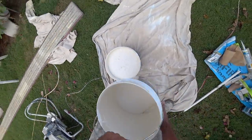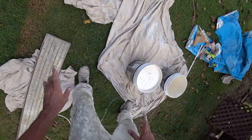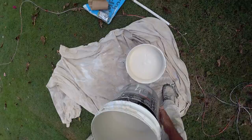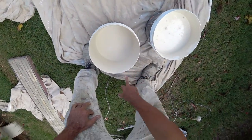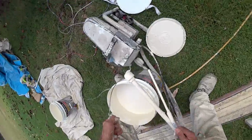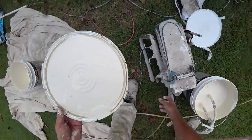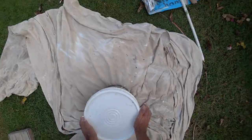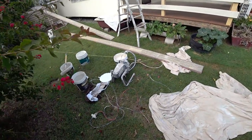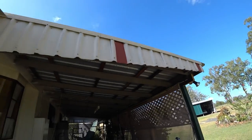I like to leave the paint I'm painting out of. What you've got to remember is one of these cans does not have a sticker on it with the color, so we're going to leave this one and spray out of that one first. Then we're going to put the lid on this one because that's the one I want to finish with. I don't strain my paint — don't have to. Seal that one off and just go over with the other paint. It's a spare now. Ready to paint — this section here goes across, just going to spray it out with the wall color.